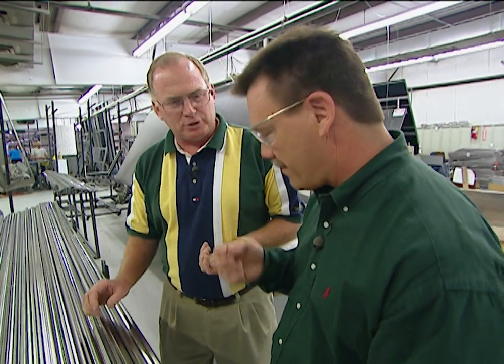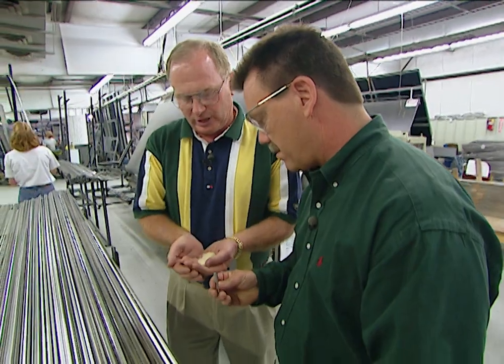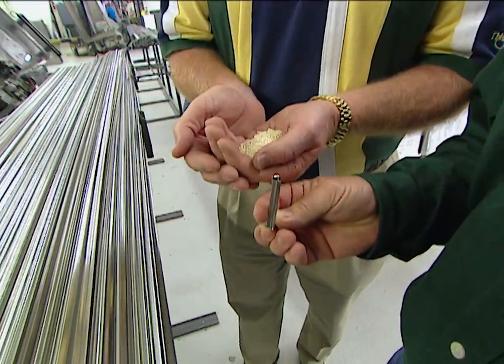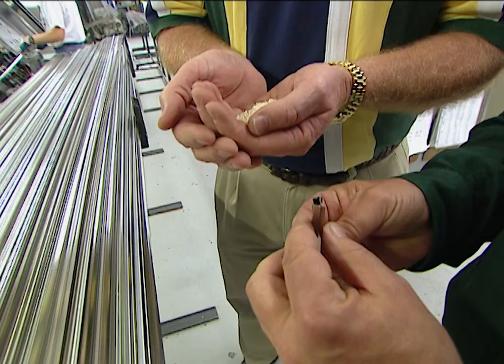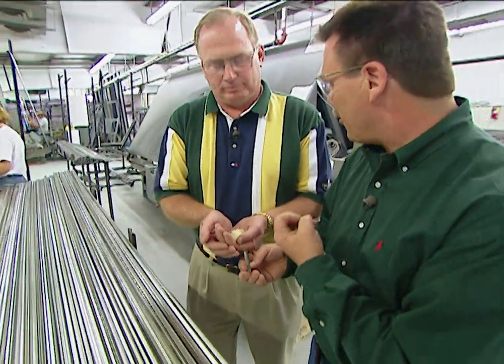There's a dead air space between the panes. The spacer is filled with a desiccating material — a molecular sieve desiccant used to dry any ambient moisture from the space between the two pieces of glass. Moisture is our enemy: if moisture gets between the two panes, it causes the window to fog and you lose the ability to see through it clearly.